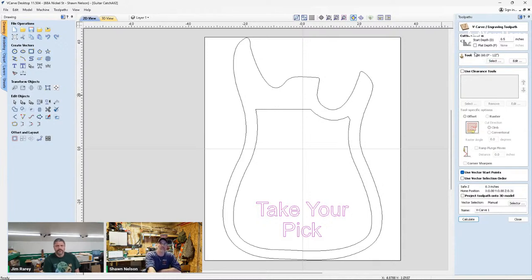It's very important that when you use a V-bit you have the proper degree and proper bit diameter. If not, your V-carve is not going to come out looking like you expect. I had to change the design because Sean designed it with a 60-degree bit and I only had a 90-degree bit - that's always something to take into consideration.